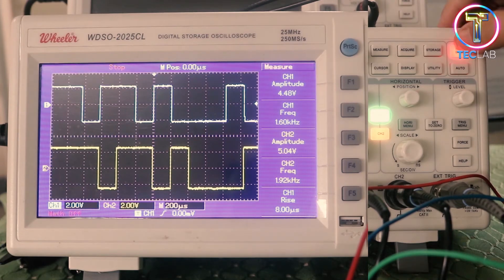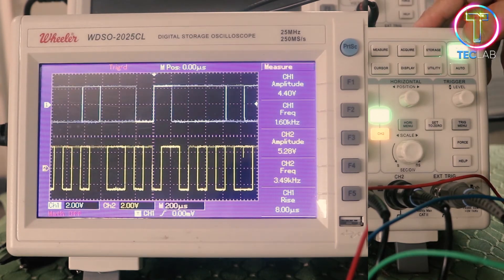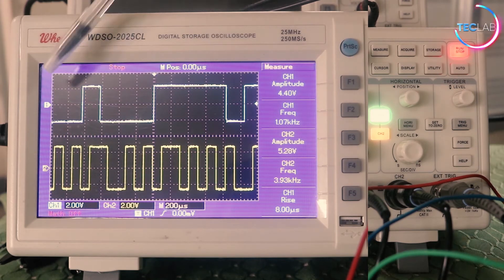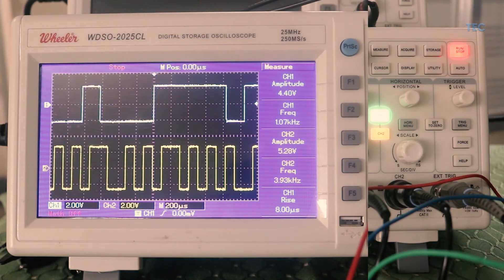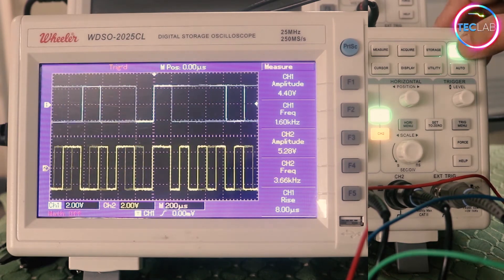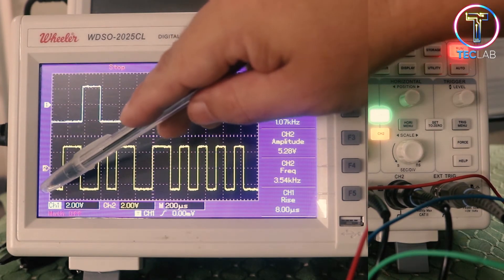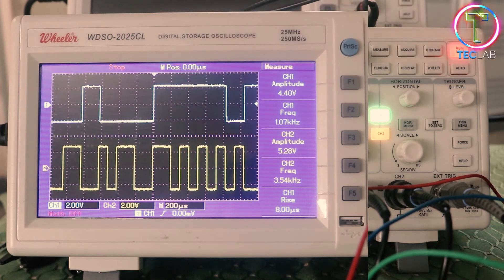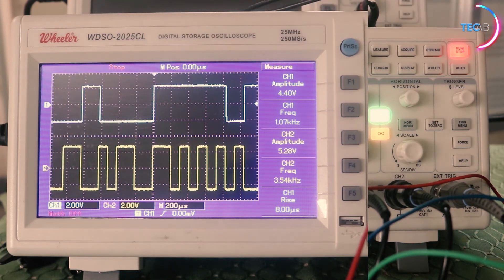You can also have the Manchester decoder — this is the waveform for Manchester. Just press run/stop. This is the waveform for our Manchester decoding circuit; this is our output data, which is the same as the input of the decoding circuits before. We can have also the biphase: this is the waveform of our biphase — this is the output and this is the original input. The logic zero is one state, and inverted would be logic one.